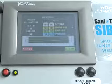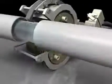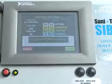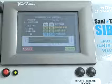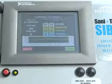A successful weld is achieved through the programmed temperature and time for the specific materials. The cleats on the weld head provide inward pressure, while the inner bore is being protected by the proper outward pressure of the bladder. The screen data is all captured for the weld document that can be accessed using the assigned weld number. The weld cycle will take approximately 10 minutes and is based on the material being welded.